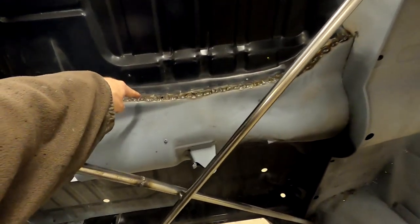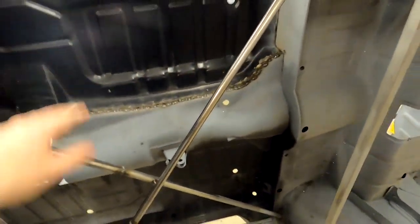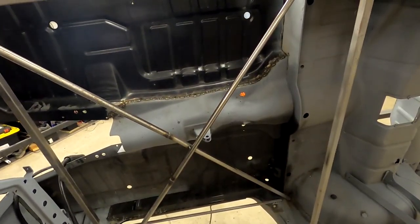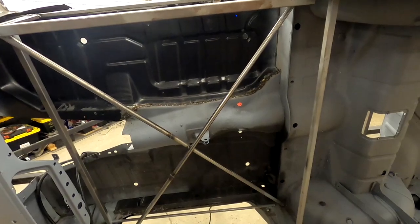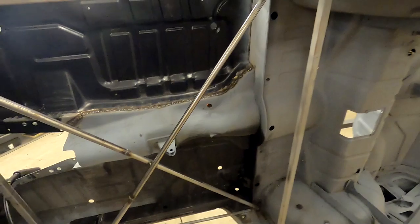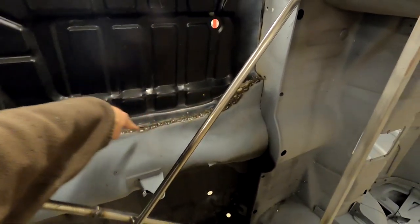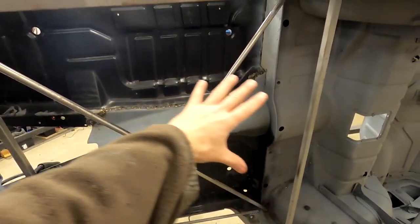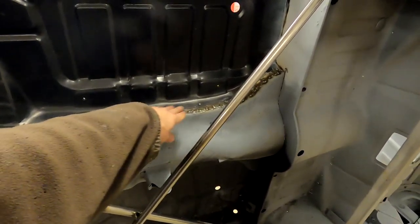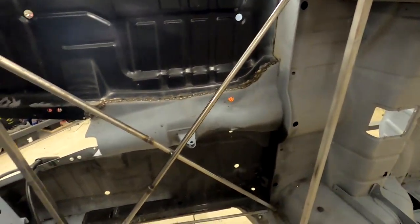It's not all the way welded. There's still some spots you can see. Basically like this, you can't just run a bead from one end to the other. You'd put too much heat into the panel. And aside from burning through the super thin stuff that is this, which feels paper thin even on the lowest voltage, you can't just run a bead all the way across. It'll warp and get too hot and overheat. So you gotta do a tack, do a tack, do a tack, do a tack. Just sort of skip around, move around. And then when there's a lot of heat in the panel, take a break, come back, do some more.